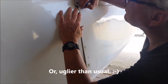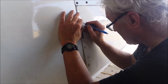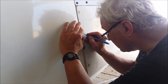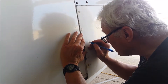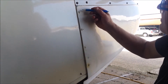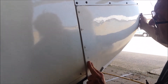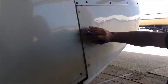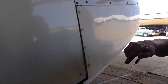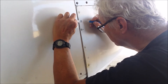So the spacing I came up with on the other side: put the first one at one inch, then go two and a half. That gives me six fasteners evenly spaced. I mostly missed the old holes — that one's a little close, that one would be okay. I mostly missed the old holes.